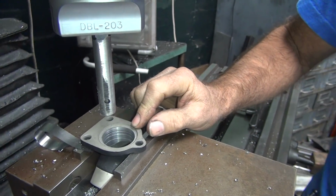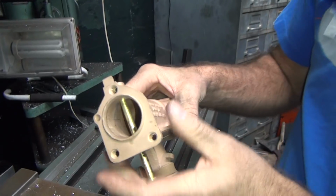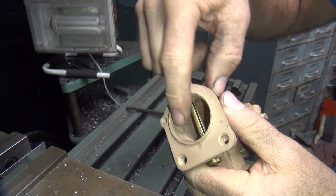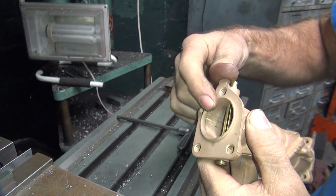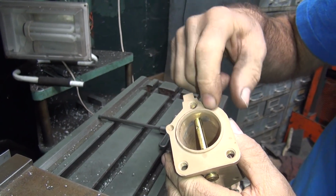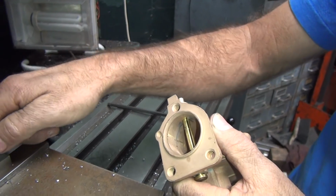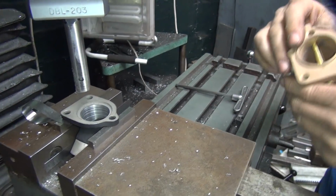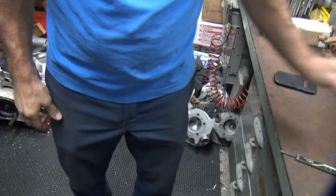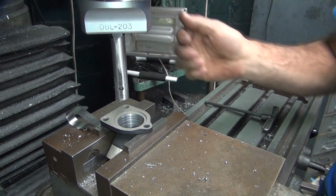Now this body here has a big taper they put into it. So you're still going to have a mismatch. That's going to be a sharp edge because that edge is put in there. Right. So to work with this body, you'd have to put a real heavy chamfer here because that air is going to want to come in and catch that sharp edge. Right. Mm-hmm. But for a regular body, that's the right size. Right. Now, gotcha. Assuming it lines up perfectly, which it never will, but at least that's good enough.